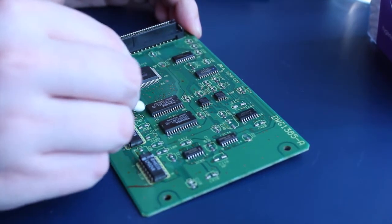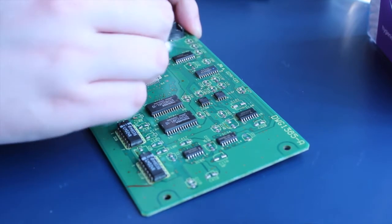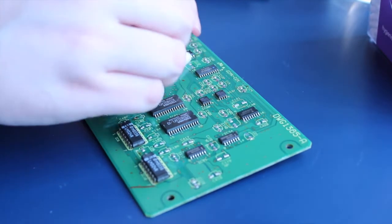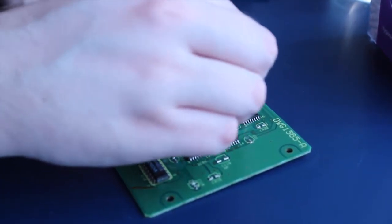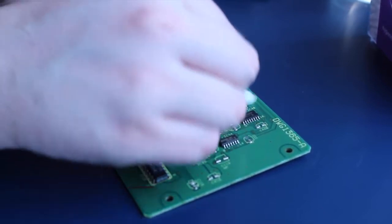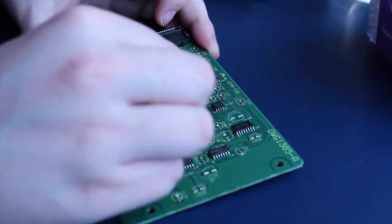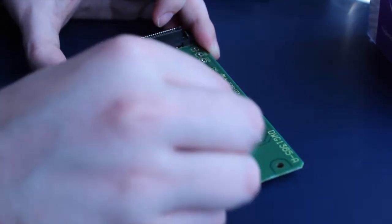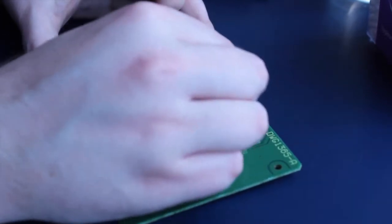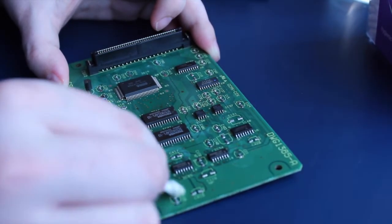And the good thing about being able to fix up these broken pads is that there are vias everywhere. So that should be easy enough to fix all the damage. Of course, an easier idea is not to do the damage in the first place. Of course, it might not be avoidable, but anything's better than caps leaking everywhere. And I must remind myself before the very end to make sure there are no shorts. So apparently if either of these boards short, they will take out the LaserActive, which is not very desirable.